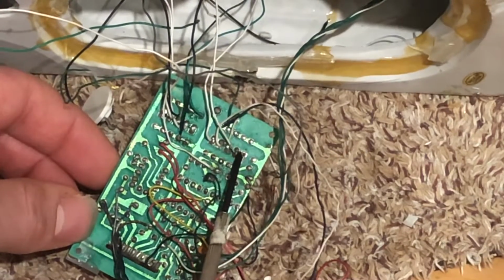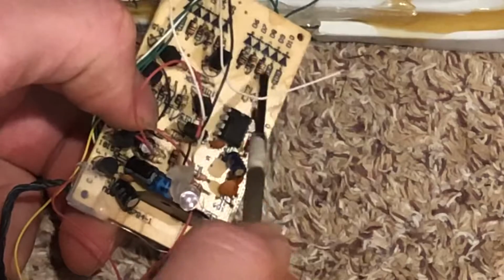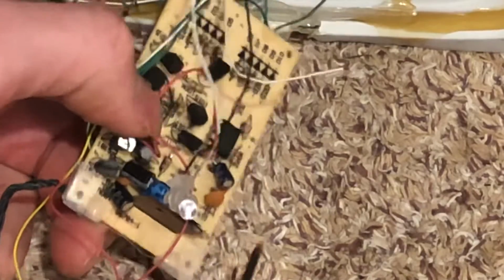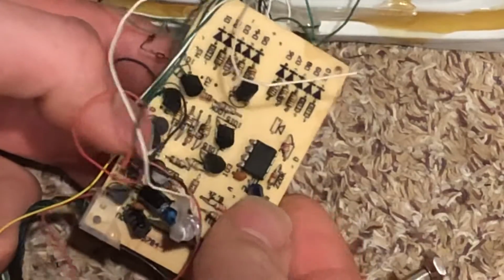And so your LEDs are all going to be connected in between the negative and positive output from the resistors. Reason why it might not work is if you don't have resistors in a few different spots. This Lemax board does not actually have all the resistors in place, so don't try and solder onto those. But you do still have spots for 7 LEDs, it looks like.